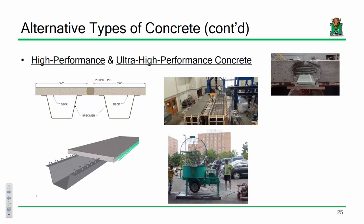What he's talking about is when you shoot shear studs on a steel bridge girder, there's a quality assurance test that happens where they randomly pick a few studs and actually whack on them to ensure that they have properly bonded to the steel. But that's usually, hopefully, not a big deal. These stud placements are pretty regular. We've got our studs every 12 inches, so it's not complicated, so it usually goes pretty fast, and that ups the QA/QC factor quite a bit.